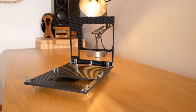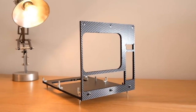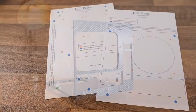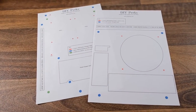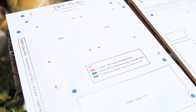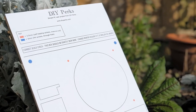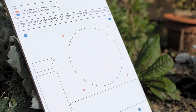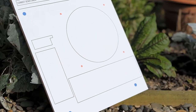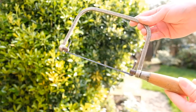The first thing to do is make the base platform. In the description you can find some templates for this, which need to be printed out onto A4 sized paper and then stuck to pieces of MDF of the same dimensions. All of the mounting holes are marked on these, and a key is provided for the correct sizes. You'll also notice outlines for the various cutouts and vents, and to cut along these we'll need the single most important tool in this entire build — the humble coping saw.